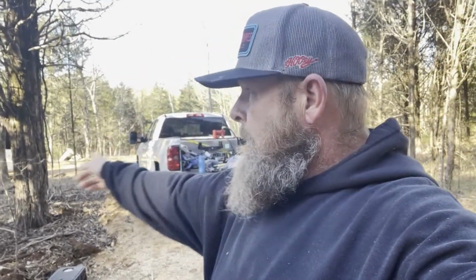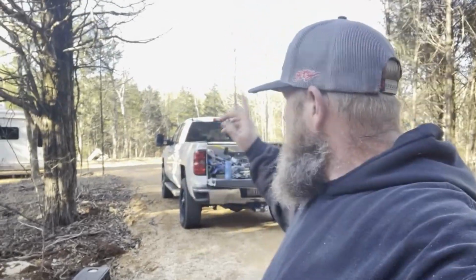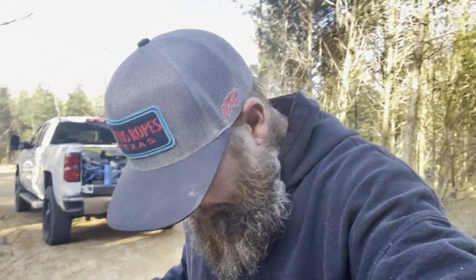I'm probably going to put another one down at the other end. That way I have a branch right there which I can take water anywhere on the property. And then coming off of this line, that's off a 2-inch main line back down there at the county road. That is subbed out to here to a 1-inch. I'm going back to a 3/4, and then I put this one in so that I can actually put another one down there on the other end of the property, and I can put in another one over here so I can make them put in the meters for cheaper.